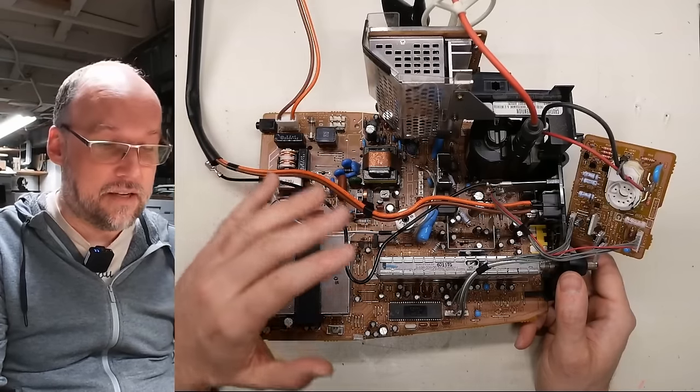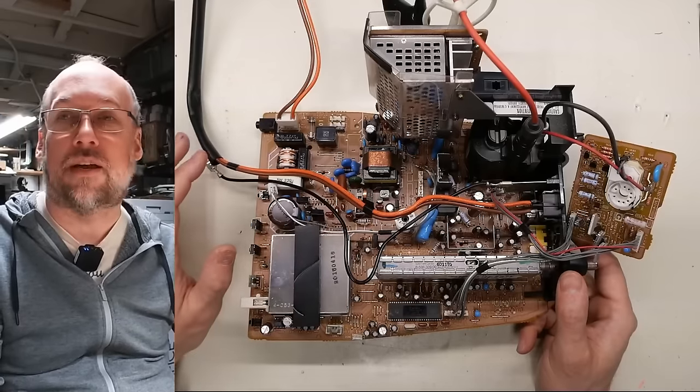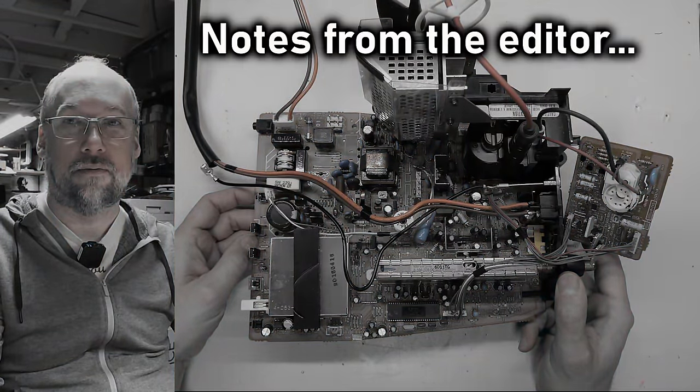While we're looking at Sony TVs, other brands work in a similar fashion, but the chips and locations won't be the same, so you'll have to do a lot of research and look at datasheets if you're trying to add RGB to anything other than a Sony TV. Also, when you do this mod, you need to be doing it on a set that has a fully isolated power supply. Older sets from the 80s and earlier here in North America often have a hot chassis — meaning the power supply is not isolated from mains — which makes adding an RGB or even composite input unsafe.